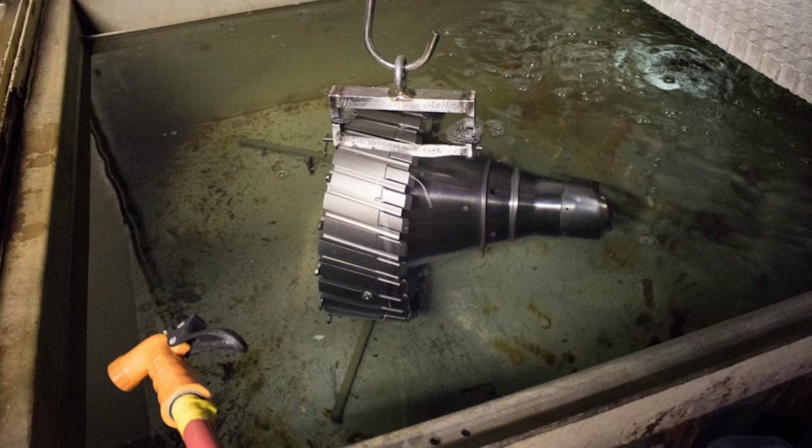So at the end of the day, some people look at cleaning their parts before testing as an added cost, added time, and another step in the process. But really, it's a huge improvement. It increases your chances of catching any indications, and it has the potential to decrease your costs by not letting any parts slip out the door. So we really recommend part cleaning, and there are plenty of methods to do that. We can get into it later if anyone has any questions.